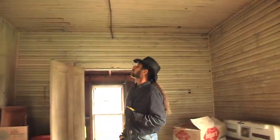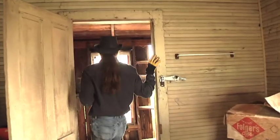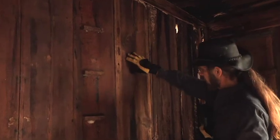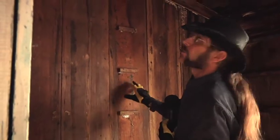As you're looking through here, we've got a lot of beadboard - all beadboard walls, all beadboard ceilings. It's incredible, nice condition. This is the first paint that was ever put on it, probably the only paint ever put on it. In the side here we have what was probably the pantry or an off room. These shed areas don't produce a lot of great wood, but they will get some nice 1x10s. This is all loblolly pine, and some of this is longleaf pine - tight grain, a little darker. We'll go into that more later on.